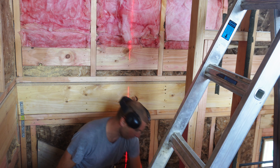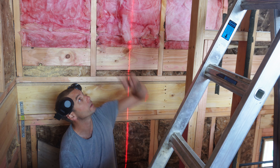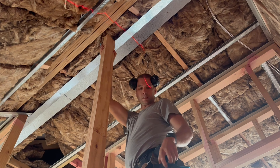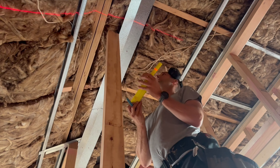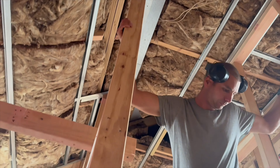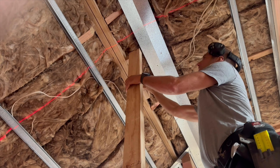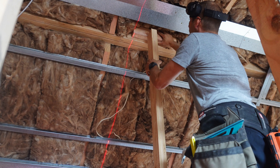The idea is to measure it here - the laser is right in my eye. Measure it there and then I want the same offset at the top and that'll be plumbed this way. Then I do the same on the other side to get it plumbed that way. And then we want the same measurement here down there, which was I think only 4. My concern is that it's got to come over one way or the other, so I'm not going to stick the block in there because then I can't bring it that way. That'll go up above it I think.